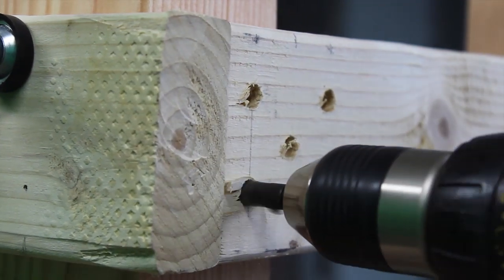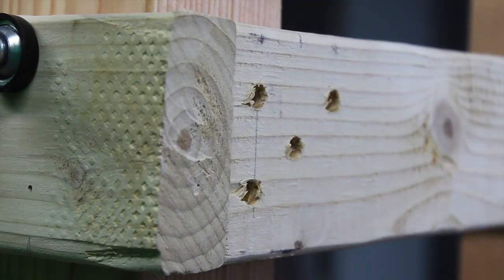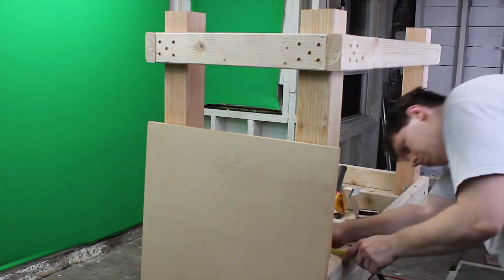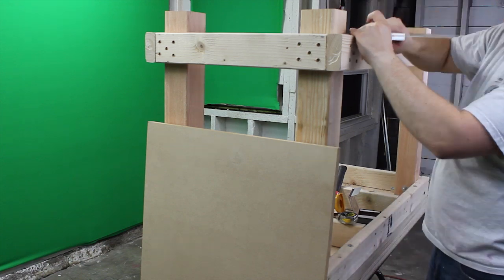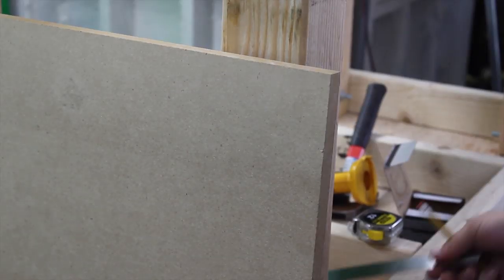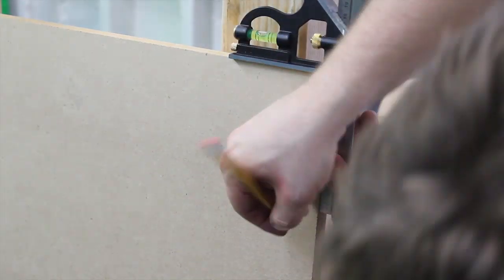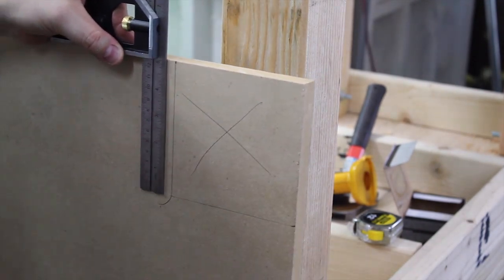Just make a little pattern — the middle is right at the inch and three-quarters mark, about an inch on each side, making a cool little five-point pattern. Now we're putting the bottom shelf in. I want to measure how deep from the edge to the back side of the 4x4 is — in this case it was five inches, because you've got a one and a half inch on the 2x4 and three and a half inches on the 4x4. Take a combination square — get one of these, they're about $13 at Home Depot and they're great. You can mark it: five inches, 100% square, 90 degrees, and cut that.